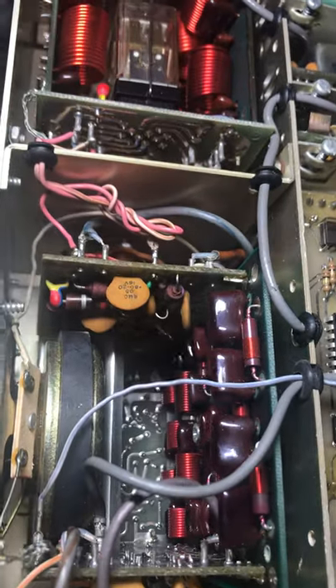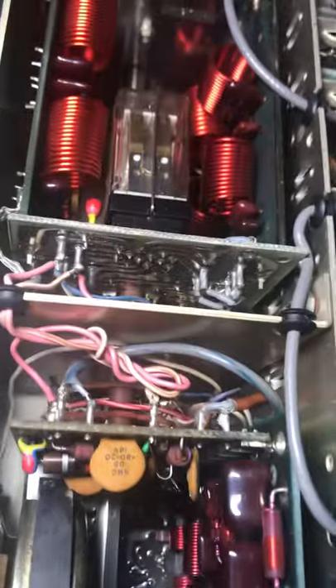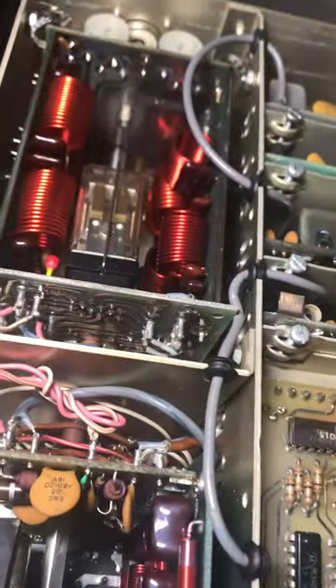This thing works as you've seen. I've been fiddling with these rotary switches and cleaning them all up. And I found one thing very disturbing. You can change the band switch here like this. There's a shaft that goes all the way through, which Drake is famous for, even in their TR4s and R4Bs and everything else. It's a shaft that always goes to the back, and the same with this guy. It's worked for them for years. But here's what really bothers me.